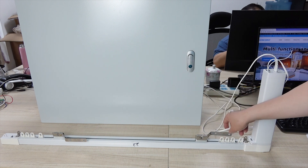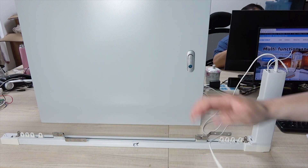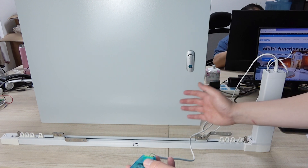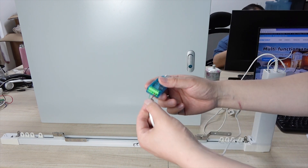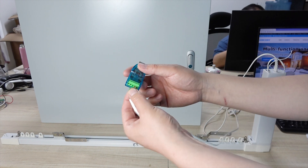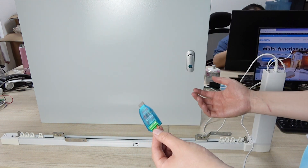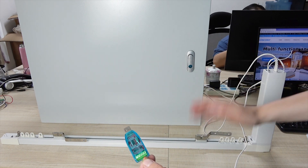But this time I will show you how to control this motor by RS-485. If you have many motors and many curtains and you install wall switches connected with relay controllers, you will need many many wires. But if you use motors with the RS-485 interface, you just use these three wires — A, B, and ground — or just A and B. You can connect many motors together and send commands from your application using RS-485 protocol.